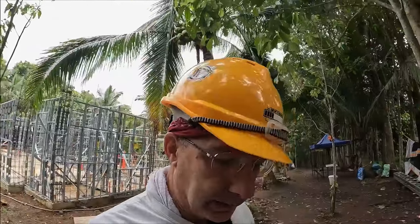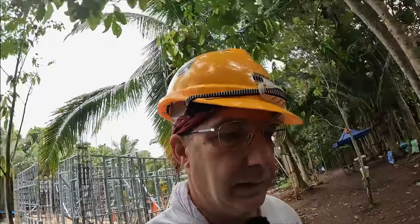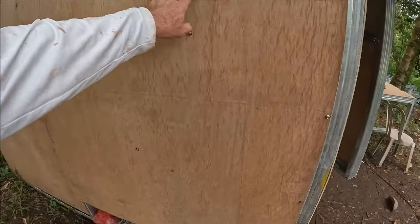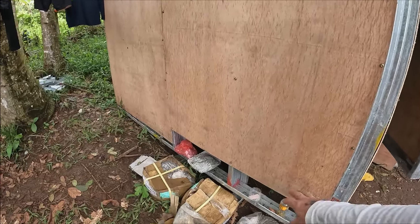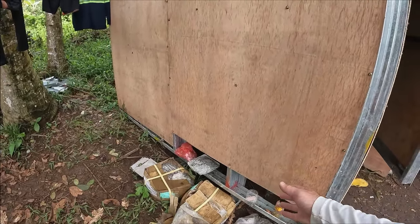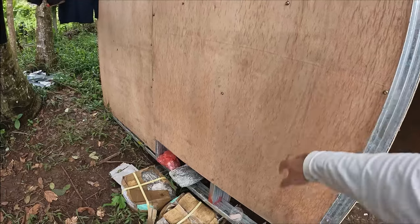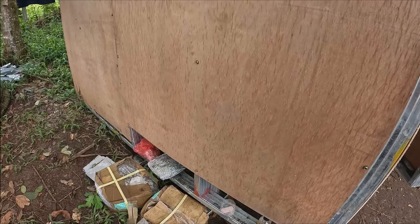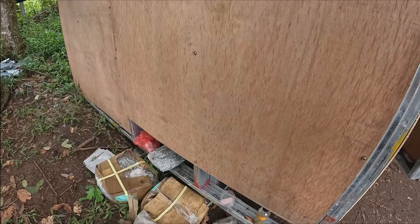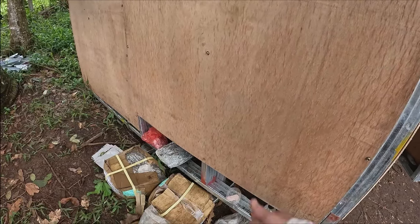One of the subscribers asked whether you can use Metalite in a non-load-bearing capacity. The answer is yes. This is the bodega the Metalite guys built in about six hours — it's simply the Metalite frame just like on the house, except you're not going to fill it with concrete. They used some cheap plywood because it's a temporary structure. But if you were putting it in a non-load-bearing surface inside the house, like making a closet, you could easily use drywall or hardy boards and just leave it hollow inside.